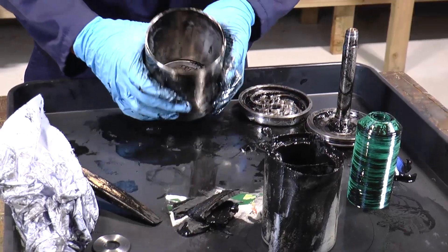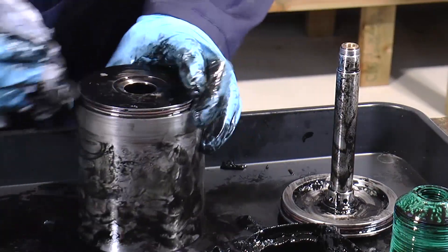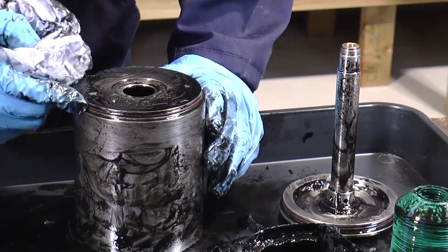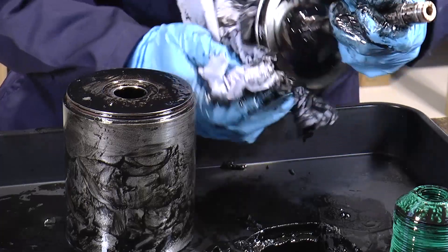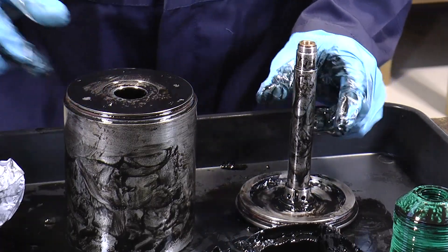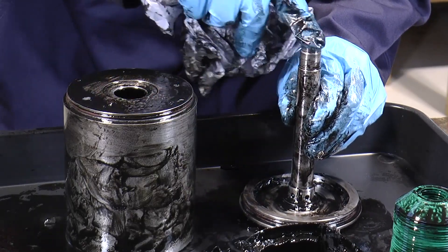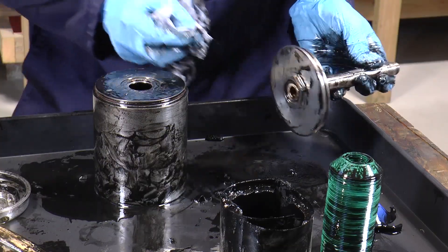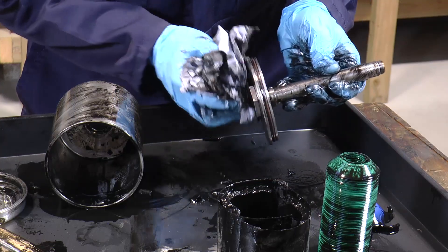If there's any more dirt in the bottom, you can tip this out. Just wipe round and we need to check that the O-rings are in good condition, making sure that they're sitting nice and tight — not brittle and with no cracks or damage — both on the top of the bowl wall and also on the bottom of the distributor. If there's no damage, then they don't need to be replaced. One of the other things to check is the bearings, ensuring that there's no scoring or damage to the top bearing or the bottom bearing. That's now all disassembled and you can continue to clean and make good as you wish.